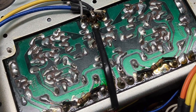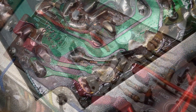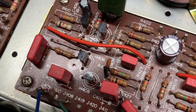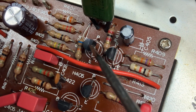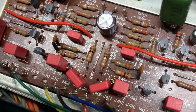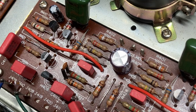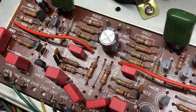So that's how that looks and I did a little repair right there — I think it turned out really nice. All the parts are straight. There was a ceramic connecting the collectors on these two transistors on each side and I'm going to leave those ceramics out and just give it a try. If there's a problem we'll just put them back in on the bottom side, which I think will look better, but maybe we won't even need them.